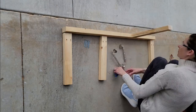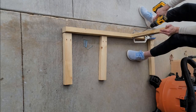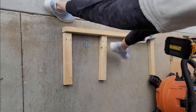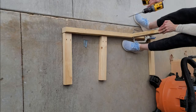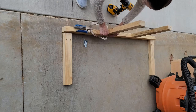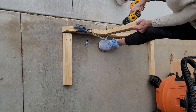For this bracket I have each piece laid out and I'm going to attach and connect the two center brackets. Make sure you're not placing the brackets where you need to attach the whole bracket to the studs — it doesn't have to be perfectly symmetrical, just avoid where you're attaching it directly to the wall. I used two Kreg screws to attach these brackets. For the outside ones my walls actually curved in, so the front of the shelf is shorter than the back. I had to mark it and attach the outside brackets later to avoid scratching up my sheetrock.